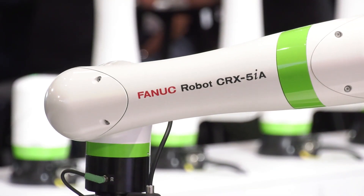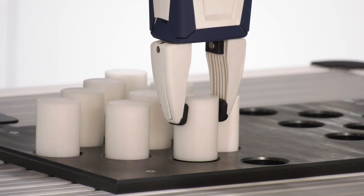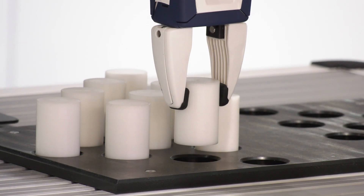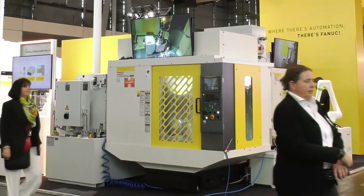And how does this work with the FANUC collaborative robots? You need one cable. The collaborative robot here — in this case we can even come through the side or from the front of the machine. You need one cable to connect the robot drill with the CRX, for example. And then you can have a load and unload operation to bridge a lunch break or make a third shift in the night.